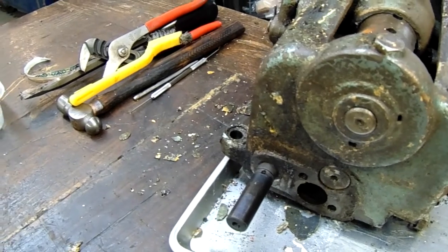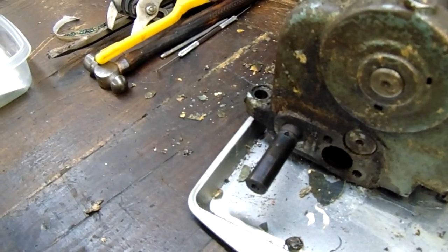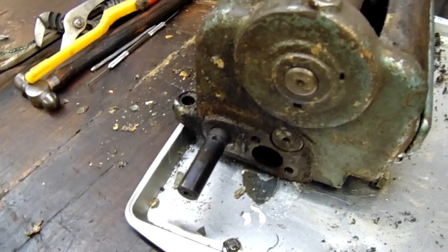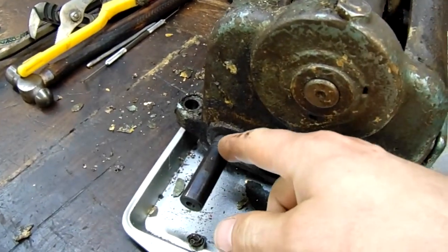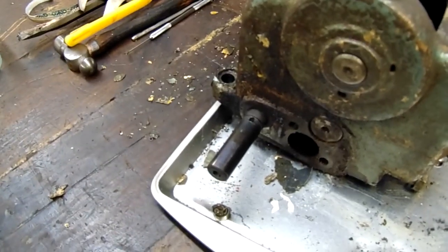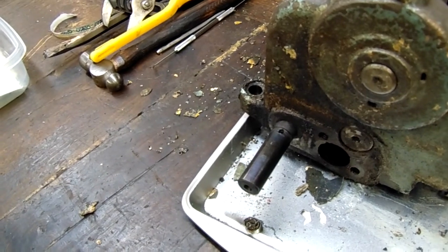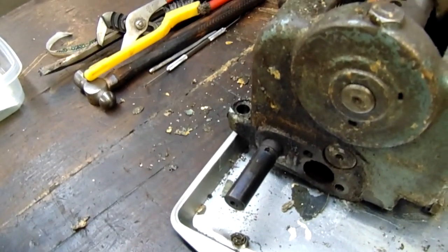I ended up having to drill this pin out. When you drill a taper pin out, you want to drill it with a bit the size of the smallest end of the pin so you don't disrupt the tapered hole and have to redrill it. Taper drills and reamers are a little pricey, and if you don't use them all the time you don't really want to buy them for one job. Once I got the pin drilled out, I could pop the pieces out, but still couldn't get the sleeve off. This leads you to the question of how to disassemble something with the least amount of repair in the end, because you're going to have to cut something, break something, or force something apart.